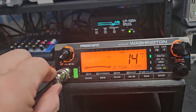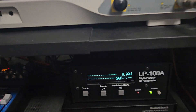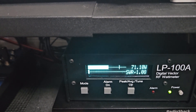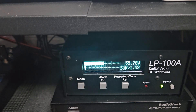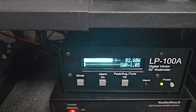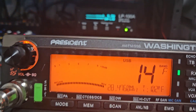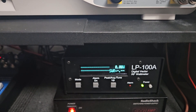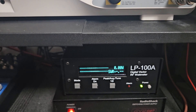I'm going to put the mic on here and check the power. The fans are kicking because I have the level set to make them run all the time. This is sideband power — hello, check, one two, hello, radio check. It's doing the rated output of about 80 watts at times, sometimes a little less — we're not giving it all she's got. We have a more respectable and cleaner signal. Every once in a while you can still see full deflection on the front. If you don't have a good quality peak-reading meter you're not going to see this power anyway.